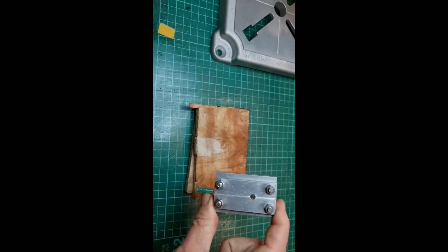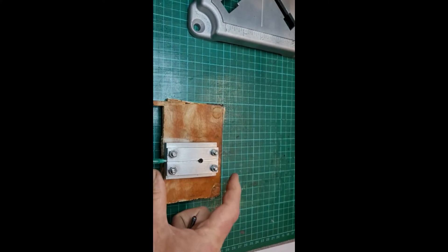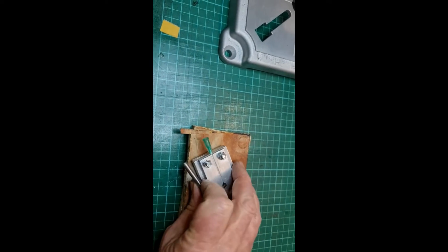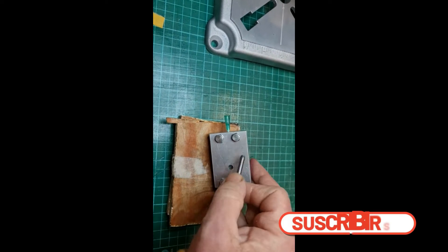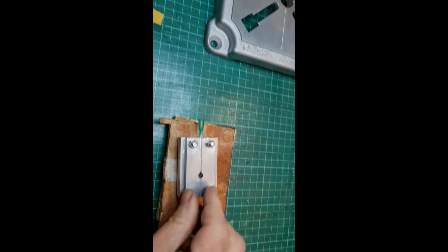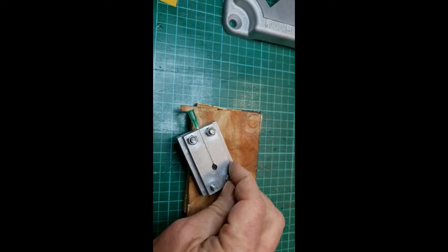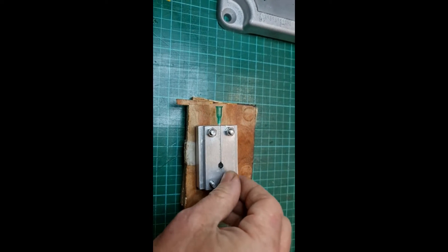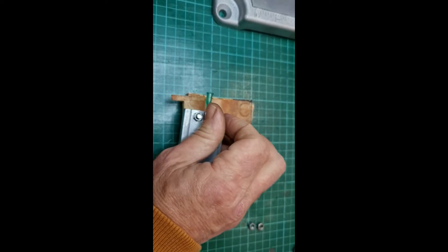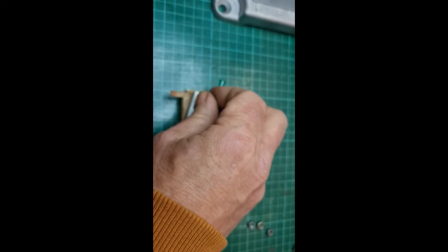What you basically do — I've made a little tool. The syringe goes in there. It's a 0.8mm, I think it's 18 gauge syringe. And there's a hole. You've got a 5mm dowel with a chamfered edge. That gets pushed in the back there. This is a syringe that was done and didn't pass muster — the tip wasn't bent over properly. I'm just literally showing you this for demonstration purposes.